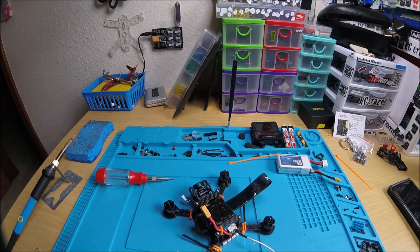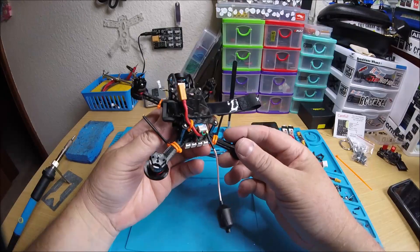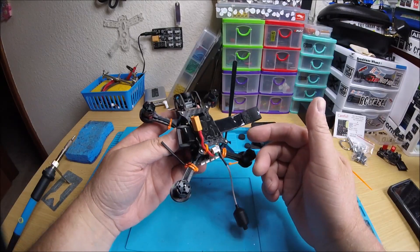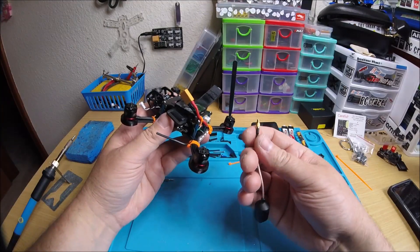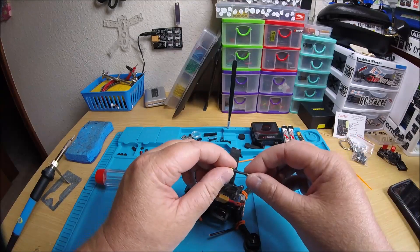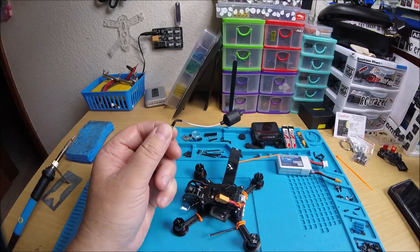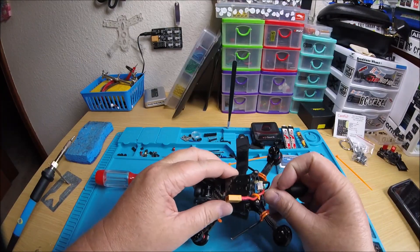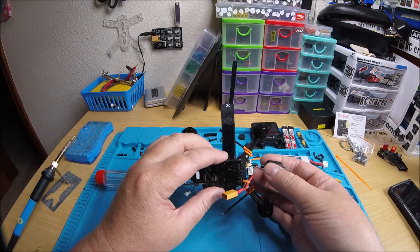Alright, what's up Brown. I got your Nemesis X just about done. I really don't know what I'm gonna do with this antenna because there's no other place to put the VTX. I couldn't really flip it around — this is the exact problem I was talking about in one of my other videos where I said they need to figure something out with the MMCX connector. It's so long — that's an inch right there. I could bend it here but you don't want to bend it too much or it'll break. I'm gonna have to figure something out — maybe zip tie it to itself right there. Yeah, that's a good idea.